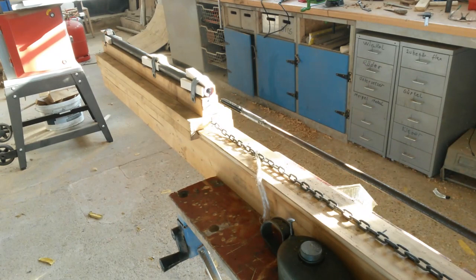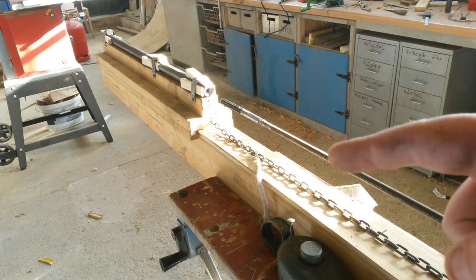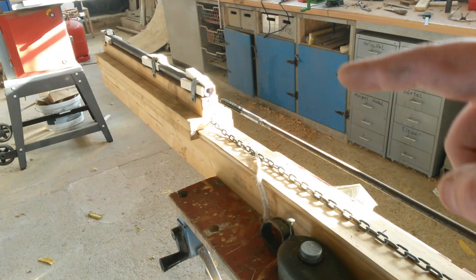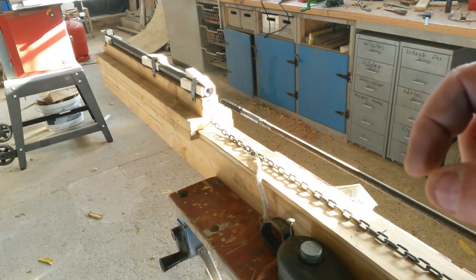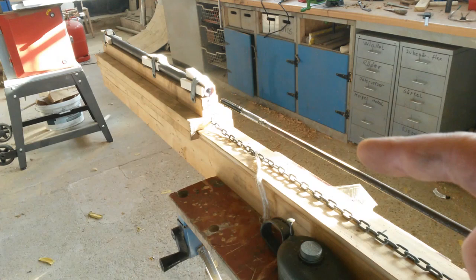So, like you can see, the reaming process is very, very slow. That will take several hours to make one groove, but then it should be good. I made several reamed barrels like that as smooth barrels, and they are absolutely accurate. There is nearly no adjustment when you make the sides completely straight. It's perfect.